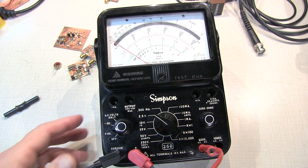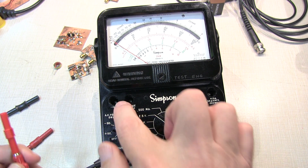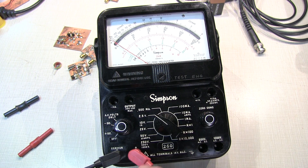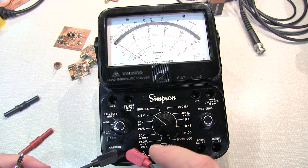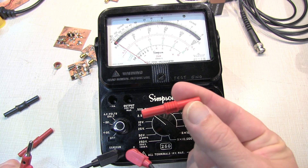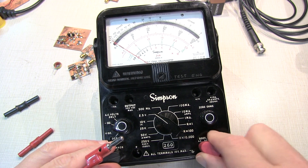One final word of caution, though, is that obviously by doing this, we've kind of bypassed the safety features and the safety reasons why these plugs were used in the first place. So my advice is, if you're going to do this, use this only for the relatively low-voltage applications. If you're going to be doing any high-voltage work — 250-volt scale, 500, 1,000-volt scale, etc. — I wouldn't recommend using these because they may not provide you all of the safety protection that the proper leads would when used in those jacks.